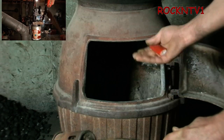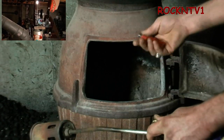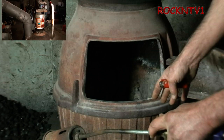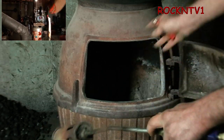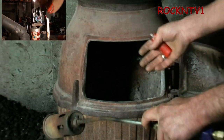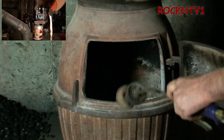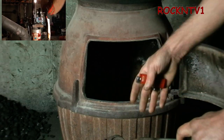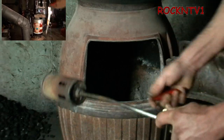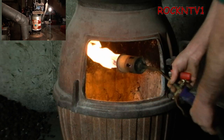The coal burns by sucking air up through the bottom — unlike a wood fire that wants its air over the top. If you give a wood fire all that under-air, you won't have any coals left in the stove at all. So in order to get coals from a wood fire with a stove like this, you need to burn it down, shut the primary air off, and just let it have enough secondary air that it lasts as long as you need.